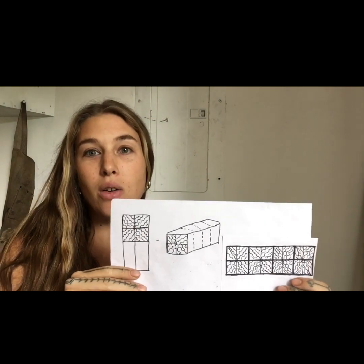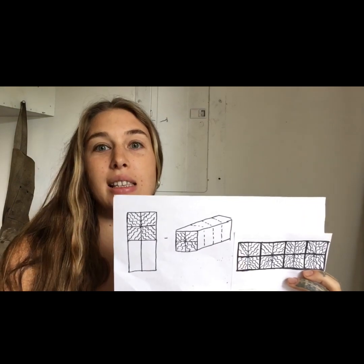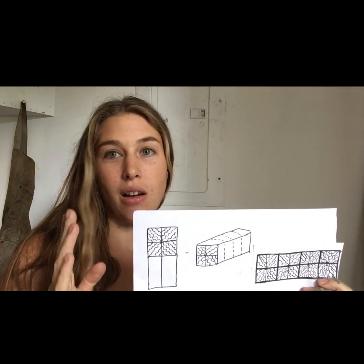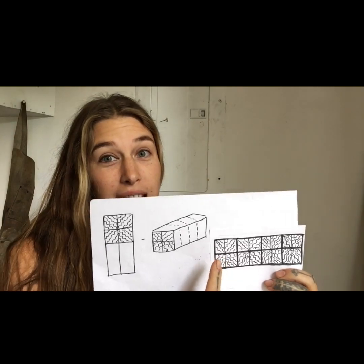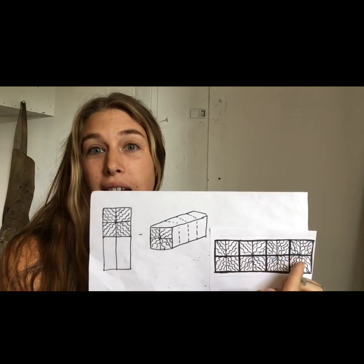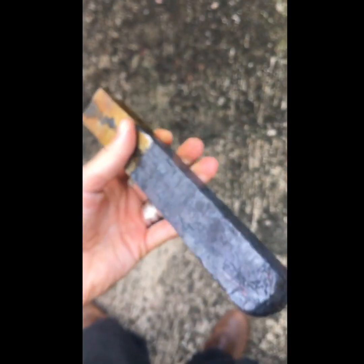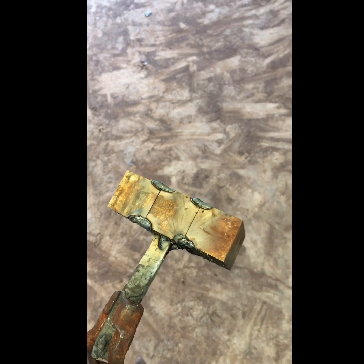What I did was tile weld this billet together. I cut it into four pieces straight on my bandsaw. Some people will do an angled cut — 30 degree, 35 degree angle — not for me. I cut it and welded these side by side. This is what the four-way billet looks like before the tile weld. Remember, you're going to grind all the scale off. This is the actual tile weld — that is the end grain up right there.